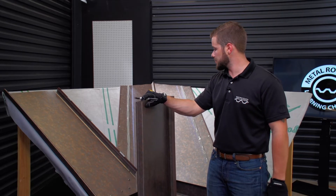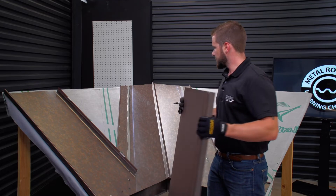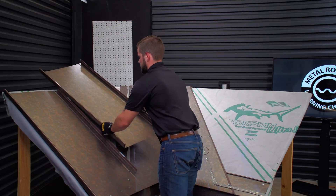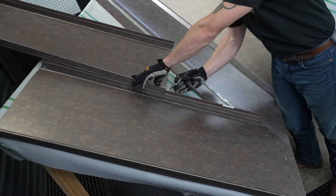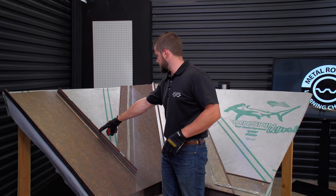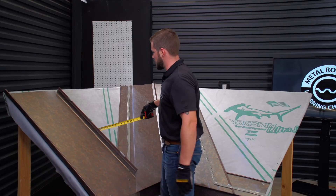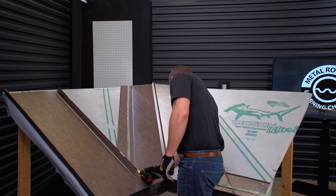Now that we've got the first panel down, we're going to repeat pretty much the same process for the second one, except the whole entire panel is going to be cut at an angle. We're going to set the panel up, get our male rib up to the blue line, and make two marks — one on the far edge where our chalk line is and one on the female rib. We get our angle by measuring up on our cut edge to our mark, which is 19 and seven-eighths. Squaring that all the way across gives us the point on the next panel. We also need our overall length: 44 and an eighth. We'll see you next time.